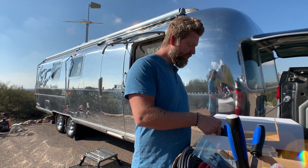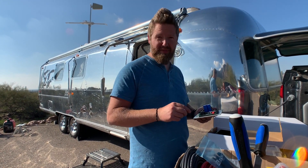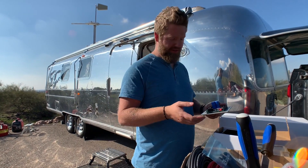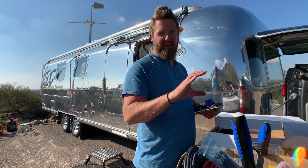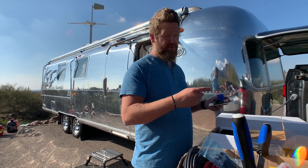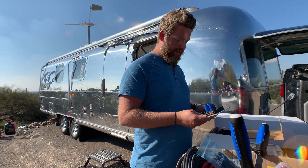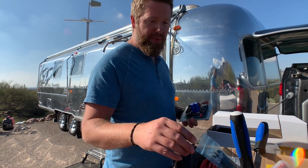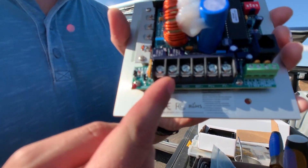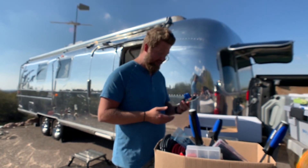We'll be putting in another 10 to 12 amps with the new panels — that's too close to that 40 amp max. So we got another tiny Blue Sky and we're actually going to chain them together. The one we have in there will be the master and this will be the slave, so it will inherit all the charge settings. Our remote display will show the total amps coming in from both charge controllers and all the solar panels so we won't have to look in multiple places. The only issue I've run into is we over-gauged all our wires quite a bit — we were hoping to run four gauge and six gauge into this, but this is all I've got to connect to, so 10 gauge max.